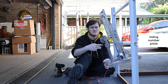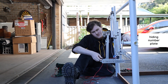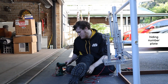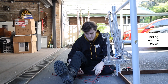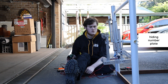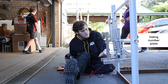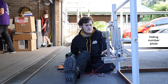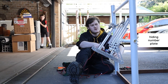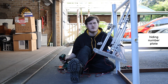Then we will push our intake forwards to shift our centre of gravity. The bars are a little bit too large — we couldn't really get the proper imperial size here in Australia, so we've got what we've got. We would then have our secondary hooks drop down alongside our first ones. That arm going out would shift the CG forwards, so when we extend we're on the other side and we can shift back.